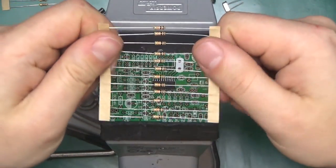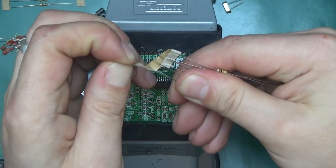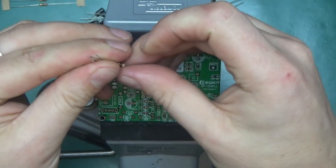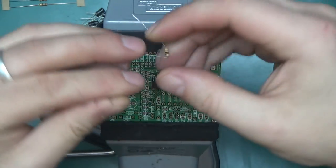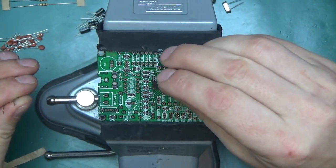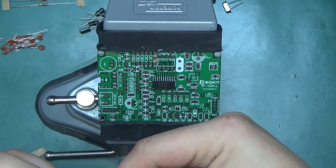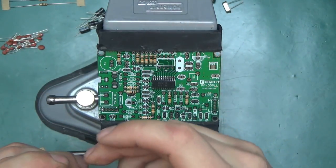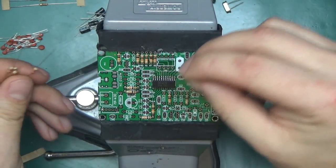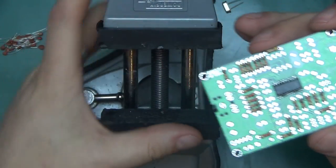Now let's stuff all the resistors in. I'm going to begin with the 10k ones — strangely those are the old carbon resistors. I know I'll anger some people by pulling the tape off like that; you should really cut them off, but I've never had a problem with the glue causing issues. I'm going to stuff all the 10k first, then the 2.2k — that's the second most abundant quantity in this kit. And those are all the resistors in. Now we have to flip it over and get it soldered.